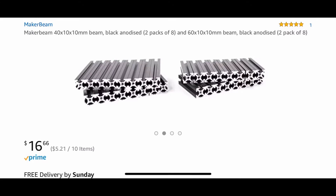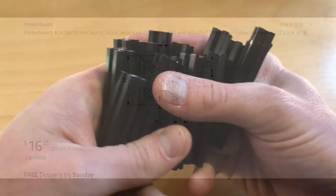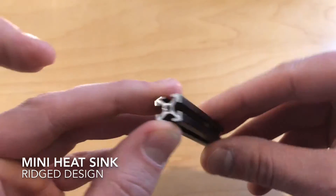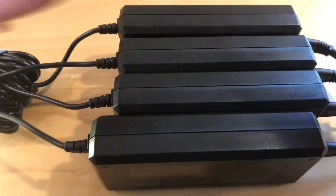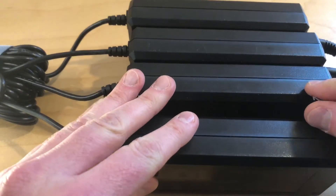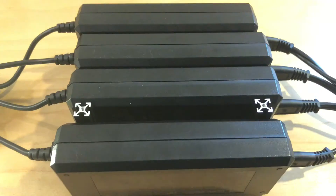Looking around on Amazon, I found these interesting aluminum extruded pieces — they're meant for making electronic kits, but for our purposes they work really well. Through the magic of Amazon, I purchased a set of these. They're black anodized aluminum, really nicely made. The ends are shiny because they're simply cut. They look basically like little tiny heat sinks, so my thought was these would be a good spacer. They're basically a half an inch, so I could slide these in and provide consistent spacing. They're obviously heat resistant because they're made of aluminum — no melting problems — and because of their design and shape, they really are like a little heat sink, so I might get some extra heat dissipation through them.